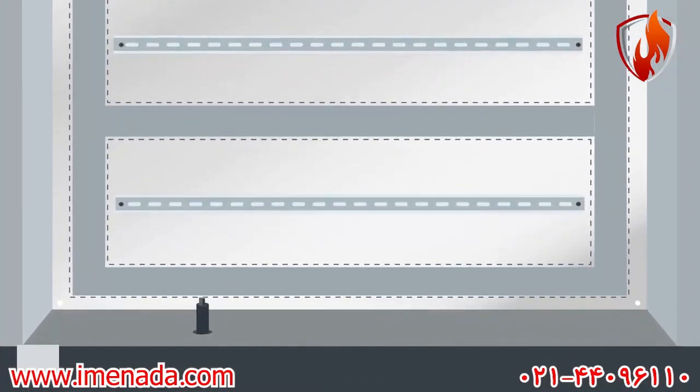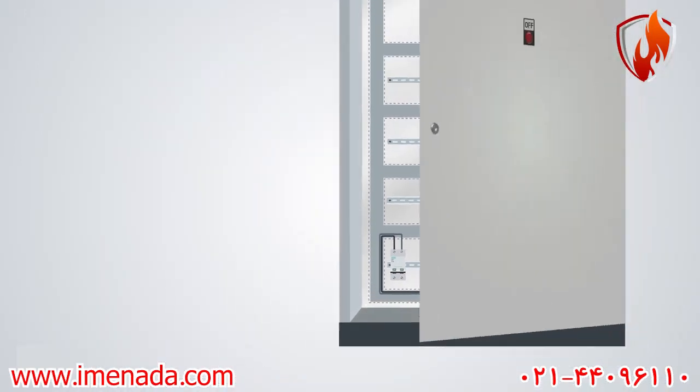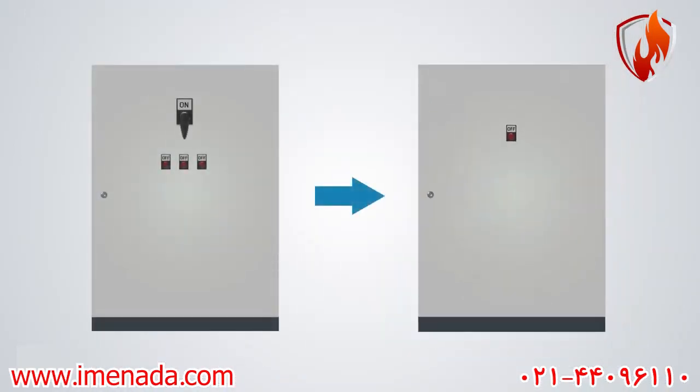Now, assume our single-phase power is entering a two-pole miniature circuit breaker, or MCB. This electric power comes from another panel within the electrical room, like a kind of low-voltage power distribution panel. Either way, MCBs are a type of protection circuit breaker that are used at the entrance of the panels with different consumptions up to 25 amps. They protect our panel from overload and short-circuit faults.